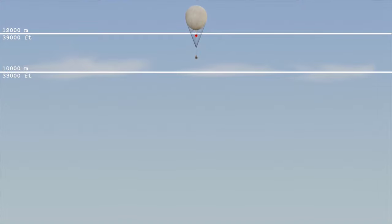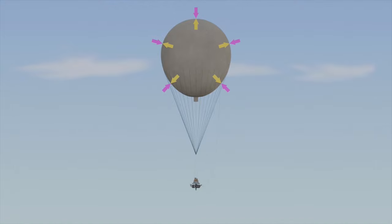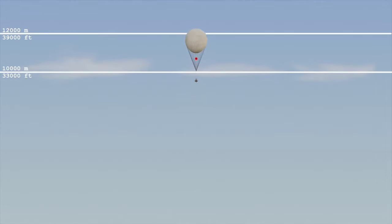When the balloon rises above its upper altitude limit, the internal pressure is so much higher than the surrounding air pressure at high altitude that the automatic gas valve is forced open and hydrogen escapes, reducing buoyancy. The ballast weight then pulls the balloon back down below the upper altitude level.